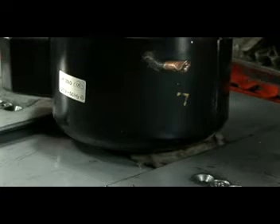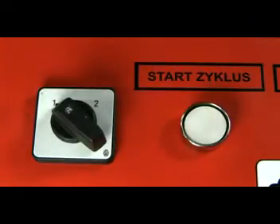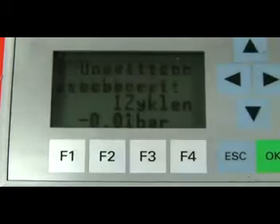The entire drainage process has been automized and begins with a push of the start button. The AFR drills a hole at the innermost point of the compressor and very effectively removes old oil and CFC gases by means of suction.